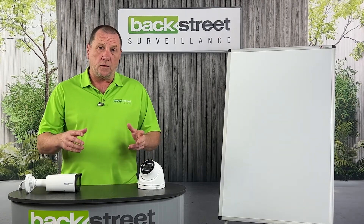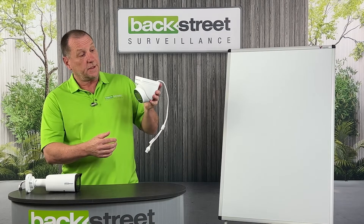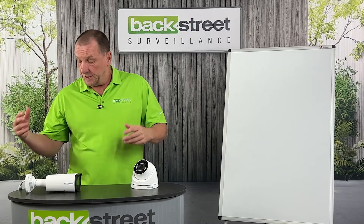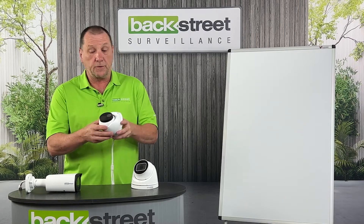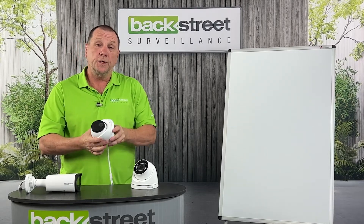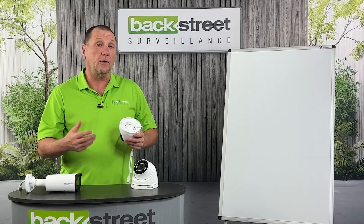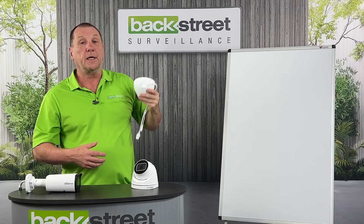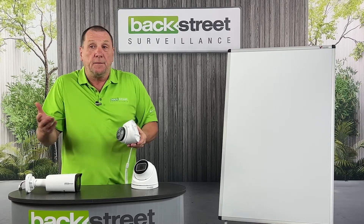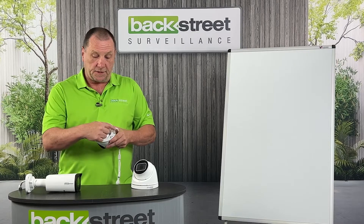When deciding whether to use a camera indoors or outdoors, this outdoor camera also looks nice indoors, though it's a bit large since it's made for outdoor use. Often when adding surveillance to a home or business, we go with a small vandal dome — they look really nice mounted in a corner, you barely notice them. Even though it's an IP67-rated outdoor camera, we use it indoors because of its small footprint. We don't want a large obnoxious camera inside an office or home. That little camera mounted in a corner looks great, no one pays attention to it, and you have great surveillance. Being sealed weathertight, it will actually last even longer indoors.